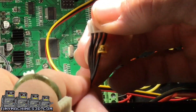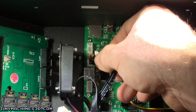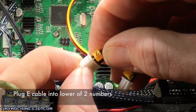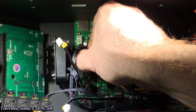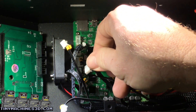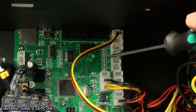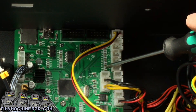It's not critical that you do these in any order. Just make sure you look at the board and plug the correct connector into the correct place. Your board will either be labeled E0 and E1, or E1 and E2. For Z, there are two connections and it does not matter which one you plug in. After plugging in all the stepper connections, we'll move on to the end stops: X, Y, Z.